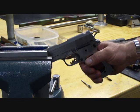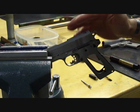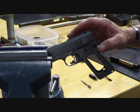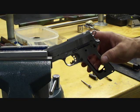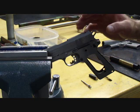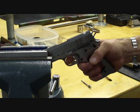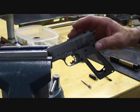When the pistol is being loaded or reloaded, the trigger is connected to the sear via the disconnect, and the jerking energy created when the slide chambers a round and snaps forward can cause the trigger bow to move slightly and bump the sear, rotating it out of engagement. If the hammer hooks are short and the sear spring or mainspring is lightened, the sear can be bumped out of contact and the hammer will follow. If the sear spring isn't too light, it will rotate the sear back into contact to catch on the half-cocked notch and prevent a possible slam fire. During the firing cycle this changes because the trigger is held to the rear by the shooter's finger, the disconnect is recessed and moved out of contact with the sear, so the trigger bow can't contact the sear via the disconnect — so there's no worry then.